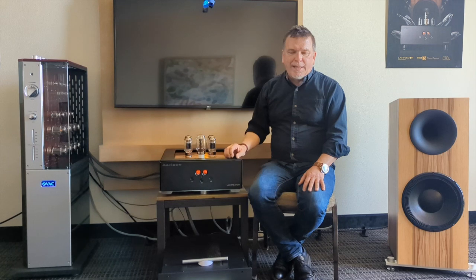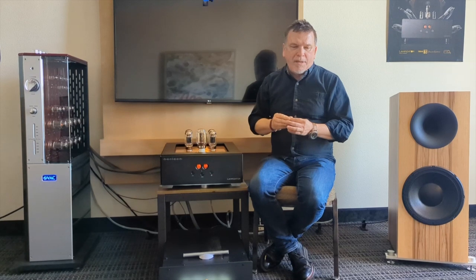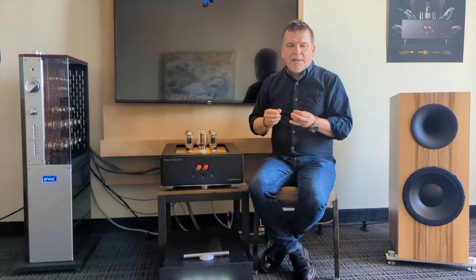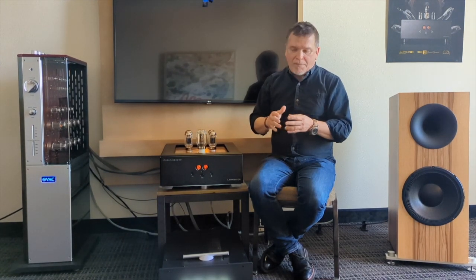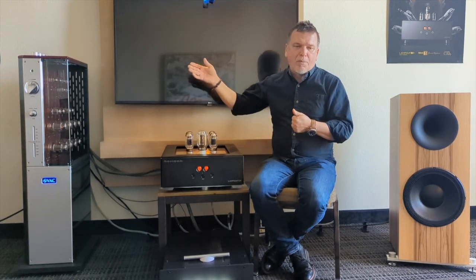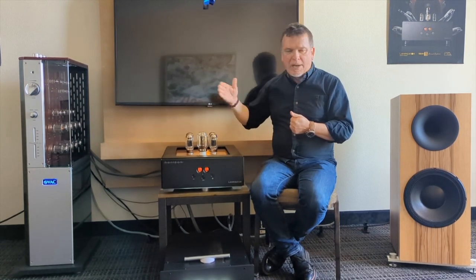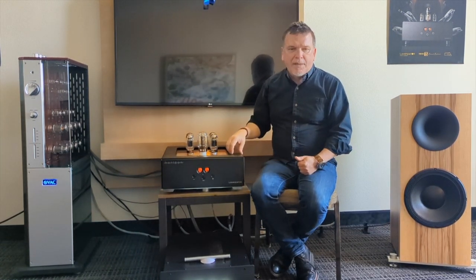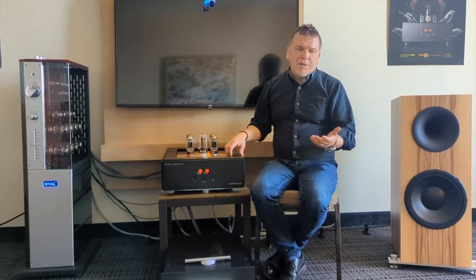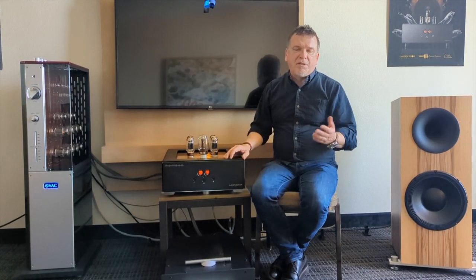So Toslink is again exactly the same as S/PDIF. It's the same waveform, the same bitrate, the same speed of sampling, the same sound quality, but it allows us to have opto-isolation from the next component. So if there are any problems with ground differences or potential differences or humming between the TV and stereo system, that is eliminated by using Toslink. And then it allows us to use long runs. Simple cheap cables go up to 10, maybe 30 feet.